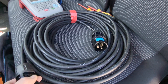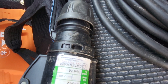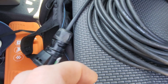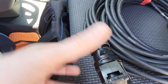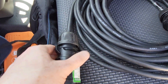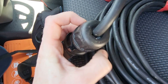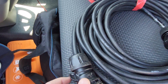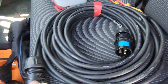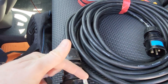So just assume this cable is okay. On these particular connectors you'll see little catches which you can open to pull the connector apart, and then you can check your terminals inside. Check there's no rust, no water getting in, and check these are all tightened up. This clamps the rubber gland on there to stop any water ingress, so you can do that on both sides.